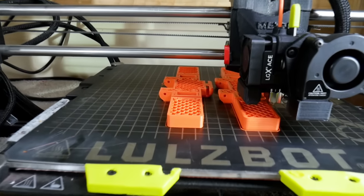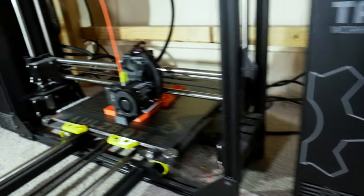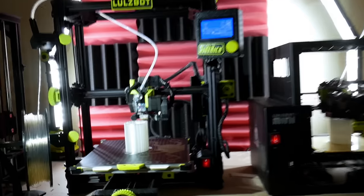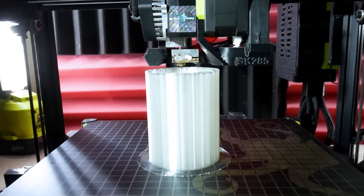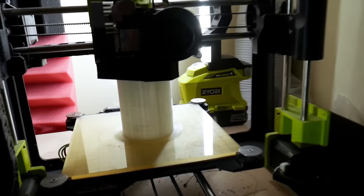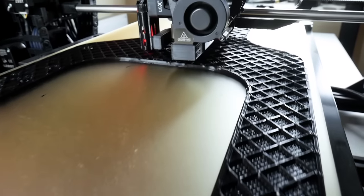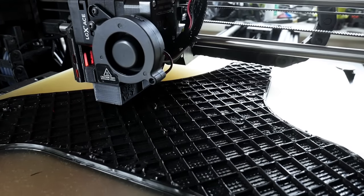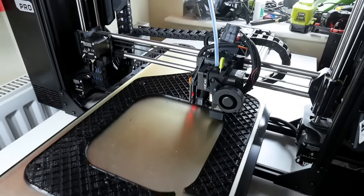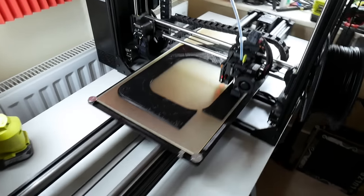This project is actually massive so I've got loads and loads of track links to print — in excess of 80 — so I'm doing these on multiple printers at the same time. There are also some TPU sections for the rollers, around 6 of those, printed on 2 printers in high density TPU. Lots of the main parts are too big to fit on the print bed, so I'm using the Lulzbot TAZ long bed which has a bed twice as long as all the other printers, and I'm also using a 1.2mm nozzle to get these parts done super quick.